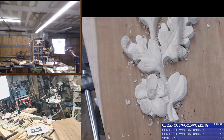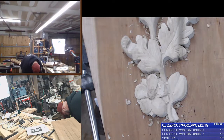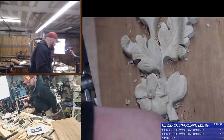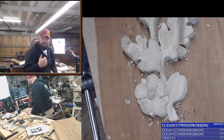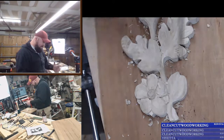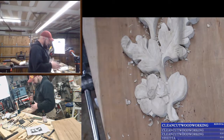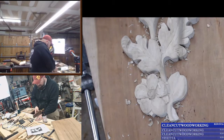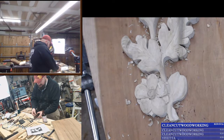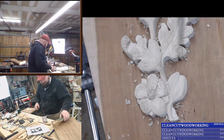Yeah, 3 TPI. The other blade was not too far off. The other one was 5. But I hated losing that 1/4 inch blade because it worked so nice. I do have that 1/8. Now I'm a little nervous putting that thing on because I'm used to having a real heavy duty blade in there, because that thing has got so much tension on it. I don't want to let it fail on me. But when you have the deck and a piece of wood in here, you always want those bearings almost touching, just in case that happens. What happened yesterday, or else it'll go flailing all over the place and catch it, or worse.